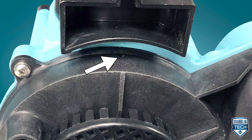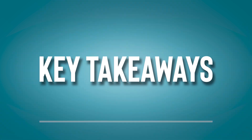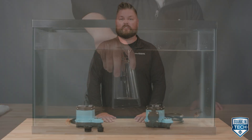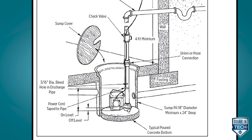In the event that this hole becomes clogged, clean off any debris. The next time your pump is running but it won't shut off and isn't pumping water, check if airlock is the issue. Check the installation for a properly sized and clear air relief hole in the discharge pipe.